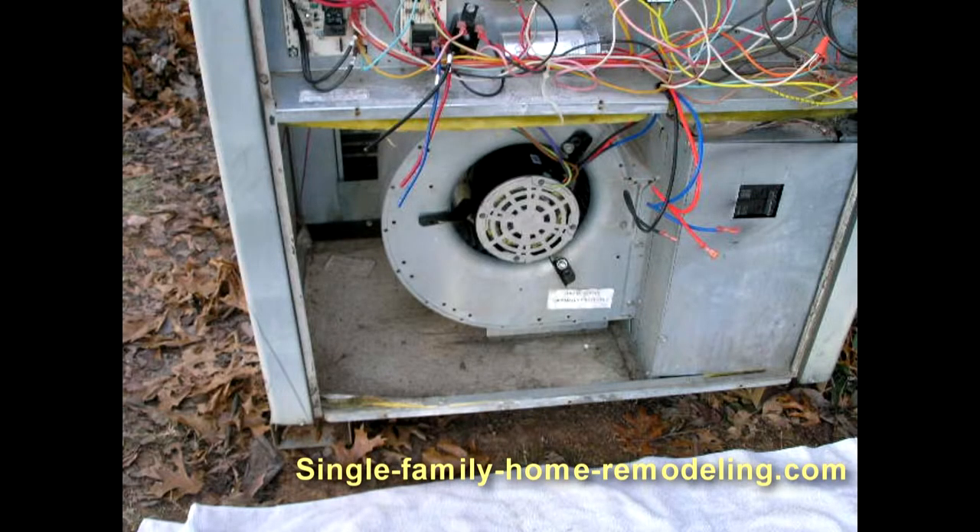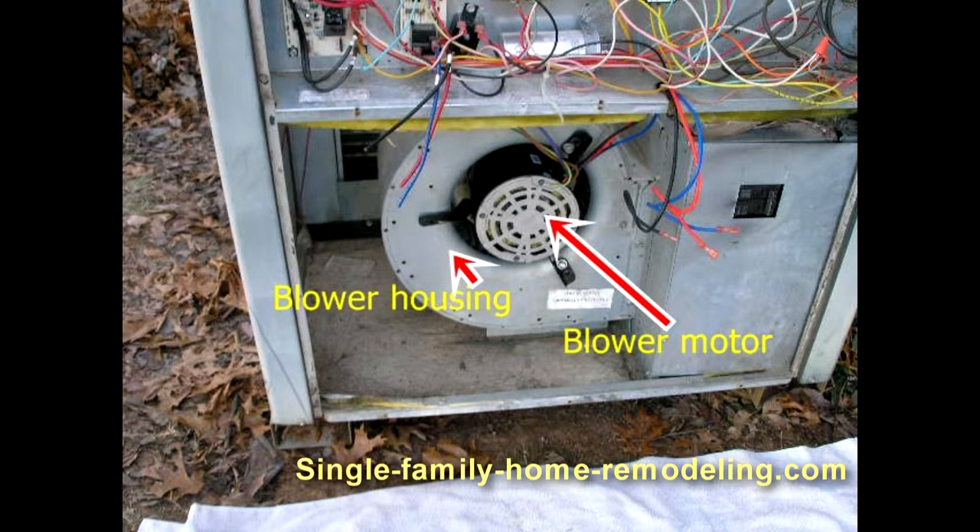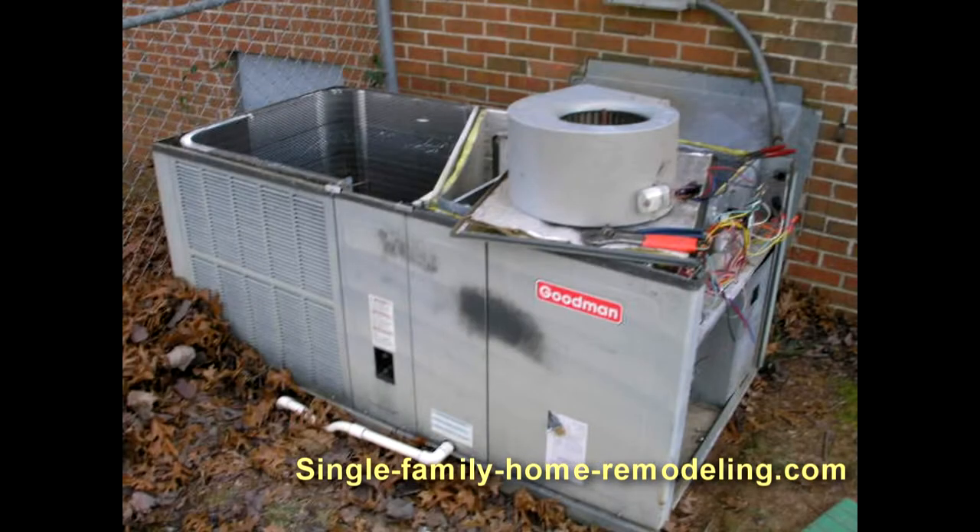Here's the blower — you can see it down there on the bottom. With the power turned off, we stuck our fingers in and sure enough that blower wheel is not turning at all. It's got a bad bearing in it. Fortunately there was protection in there and it didn't cause any damage.